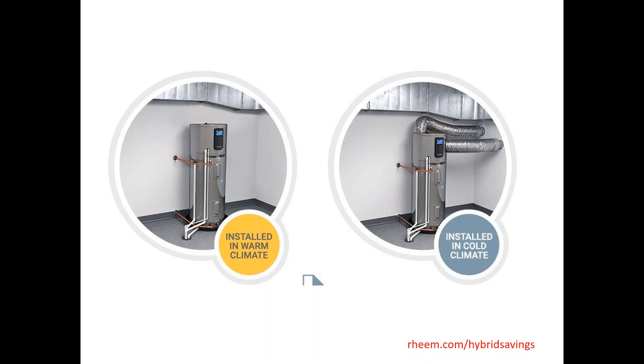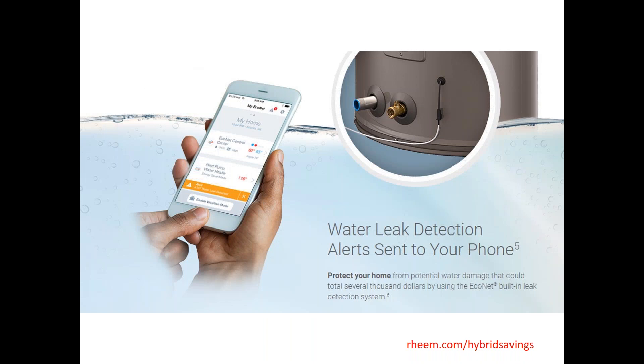There are two different ways to install this system. You can run it unducted for dehumidification purposes in the space, or in areas where you're concerned about humidity in cold winters, you can duct the system to the exterior. Some folks also duct it to the inside through a small closet with a filter. Check with your local HVAC or energy assessor to determine what makes the most sense. The Rheem Prestige also helps clients stay smart with service notifications and potential leak detection — though still make sure to use a drip pan when installing.